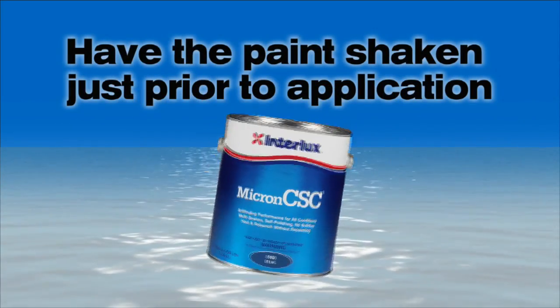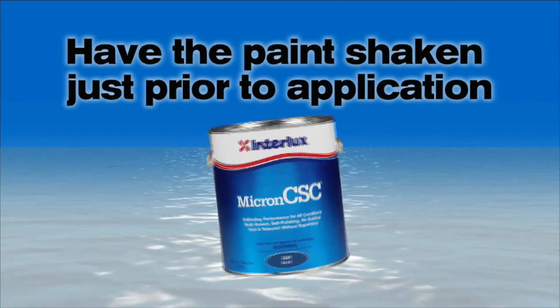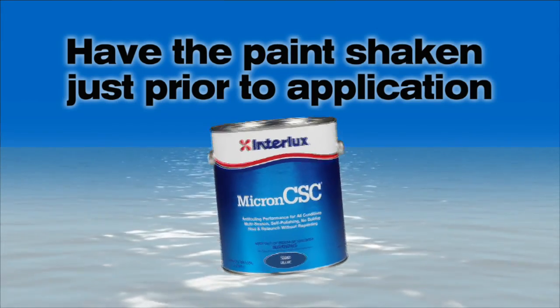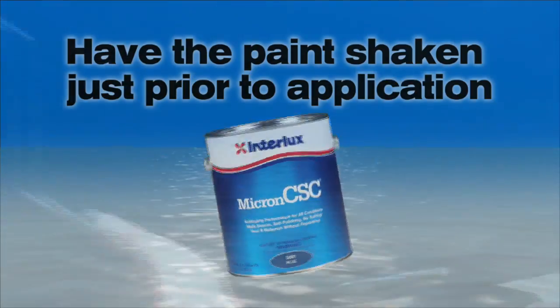Also, have the paint shaken just prior to application. This will make stirring the copper back into solution much easier, which can settle into a thick mass at the bottom of the can over time. After thoroughly stirring the paint, pour into a paint tray and begin rolling the paint evenly from one end of the boat to the other.